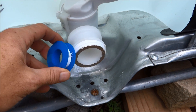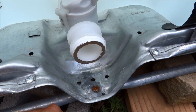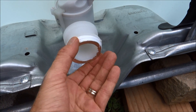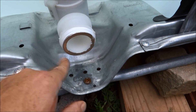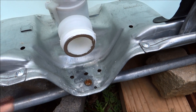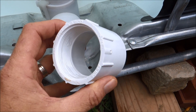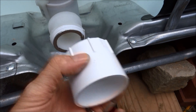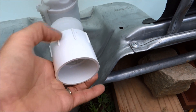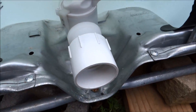The first thing I did is put some Teflon tape all around that groove — it went that way because I'm going to be tightening it that way, so I don't want to untighten it. Then I'm going to use this two-inch threaded coupler — not threaded on that side — and put this on each one of them and get that on there good and tight.